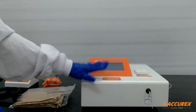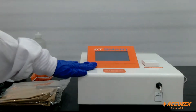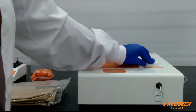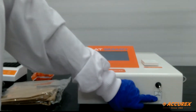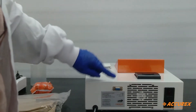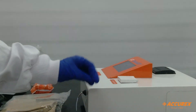Now we will see the areas of the analyzer. This right here is the LCD display. Behind the display there is a printer. Here is the measuring chamber. This is the aspiration tube and this is the aspiration switch. This is the back of the analyzer where there is a power socket and the power switch. This is the connector port and this is the drain tube. On the side of the analyzer, this right here is the peristaltic pump assembly.